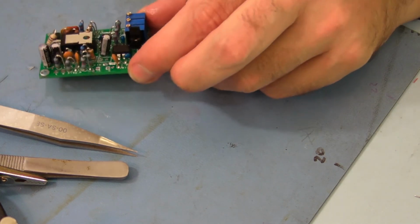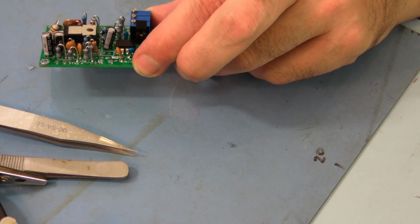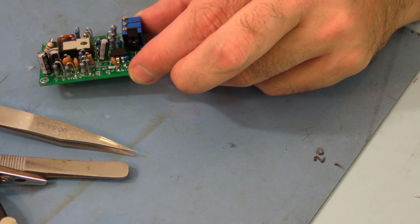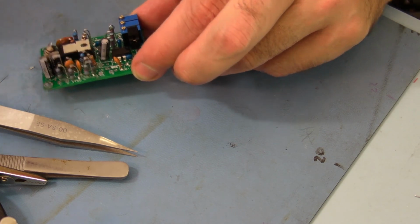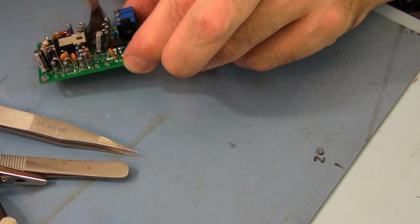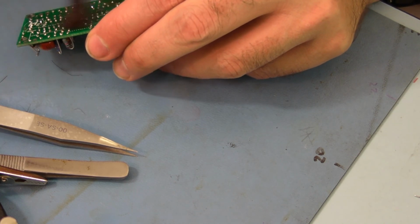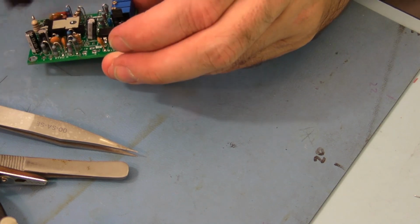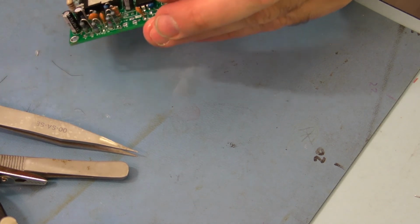And then dry the board good before you turn on the electrons, because that's what'll damage it. When you've got conductivity and electrons moving around, you make traces out of the calcium or the iron in the water, which causes artificial traces. And that's where you get into trouble. So you want really clean water, distilled being preferred on your final rinse. Doesn't have to be when you're washing. And then dry the board good.